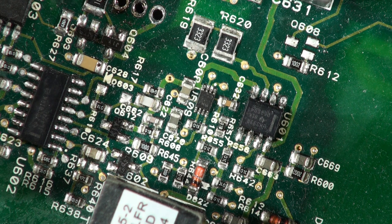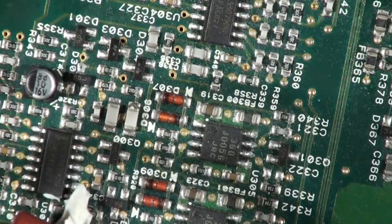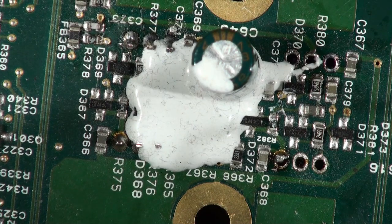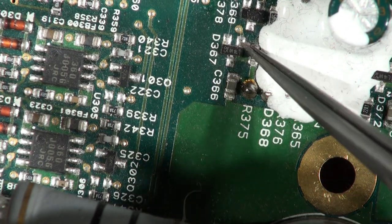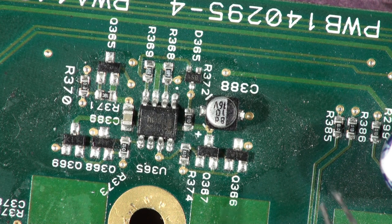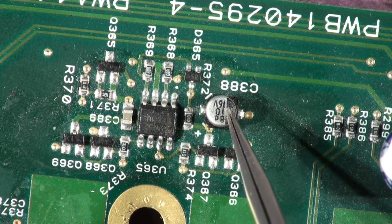On the power amplifier side — the LF amplifier — there's all the servo and switching stuff that makes the control signals, the gate control switching signals via these two drivers down here. These fire this buffer circuit up here, and two more complementary drivers, and a terrible smoothing capacitor.